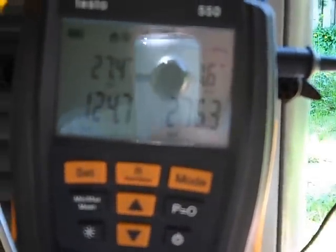The manual states that we should add three ounces for every five feet, so it should need 15 ounces. We're going to weigh in slowly and check our subcooling. We should see that subcooling come up and that superheat go down. We're going to bump it up, and once we get it up a little bit, I'll start the video up again.